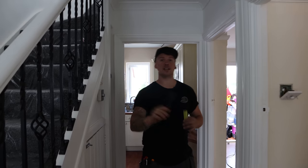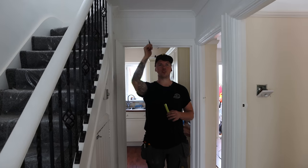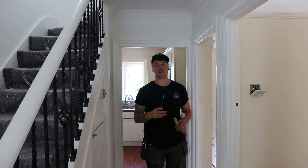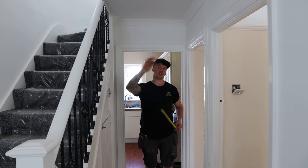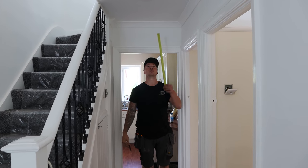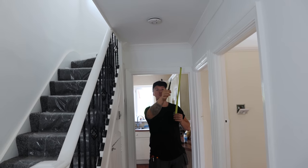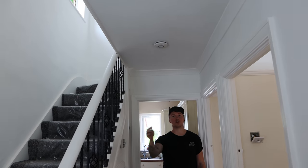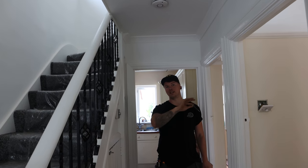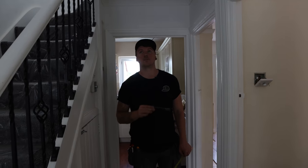If you want a straight line, it means that the downlights are going to be off centre to the entire hallway, the door frame, so visually when you walk in the front door, it's not going to look good. So what we'll end up doing with a row of three, the fourth one is on the angle, so it doesn't really count. We will do two the same distance on the left-hand side of the beam, furthest apart, and then the middle one we will kick on the other side of the beam in the center of all the different lights. So visually you can see it sits on a triangle, it's in line, it's everything it needs to be, and it's the only real way around having a beam straight back, smack bang in the center.